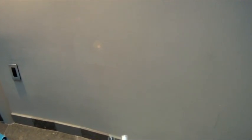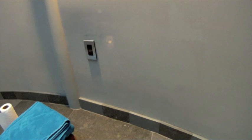Now, these are the cleaning solutions that I mentioned that are a little stronger. I got these from the Astrophysics website. One is called Optical Wonder. It's a little less strong than the Purosol. So for extremely stubborn stuff, the Purosol can be used. So let's say you had bird droppings on your mirror or something like that. Give the Purosol a try. Any other relatively stubborn issues, you can try the Optical Wonder. So these are just a little stronger solutions for cleaning the mirrors.